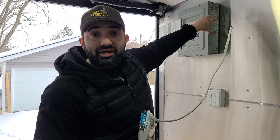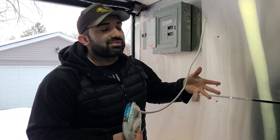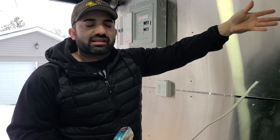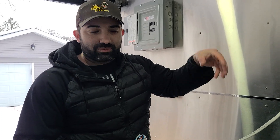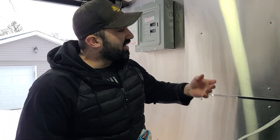I ran all my wire inside the stainless steel because I like the look of it. You can run it on the outside — you can take pipe and come from the knockouts and go out and run on the outside; that's called EMT. Or you can use what's called armored flex cable, which is like a steel cable wrapped around like a Romex as protection. I don't like how it looks — it's mostly aesthetics.